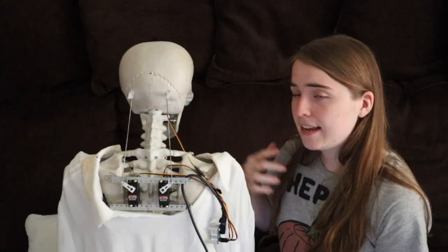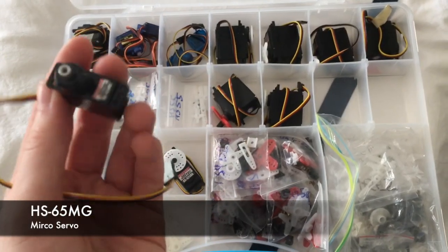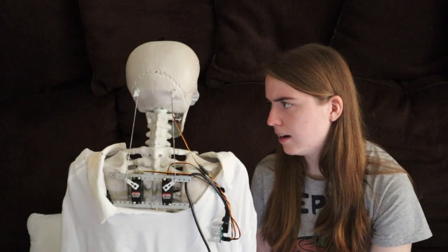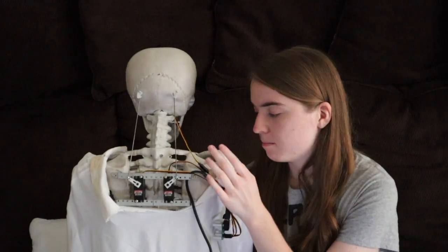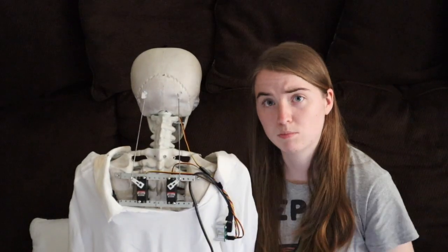In Captain and Brown, and I believe in Jones, we use an HS-65MG — it's another Hitec servo, and this one is Metal Gear. It might be overkill for the jaw, really. It's very strong, but you just really want something that's fast and responsive. I believe this one is a bit more on the expensive side — you could probably get away with something a little cheaper, but don't go for the cheapest option. Originally all of the pirates had an HS-55 in their jaws. I didn't like that servo — it was very loud, grindy, slow. We ended up switching out all but one of the pirates' jaws to the 65MG, just because the other ones were breaking.